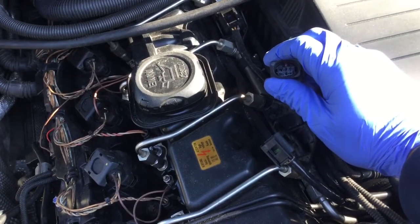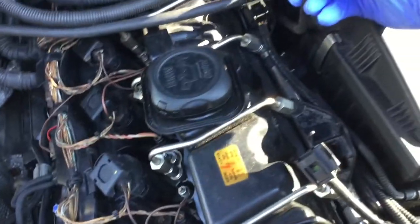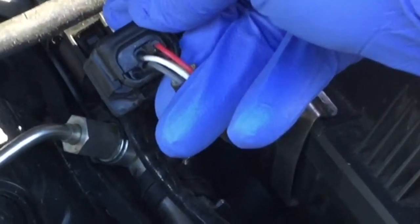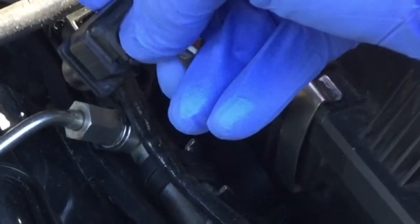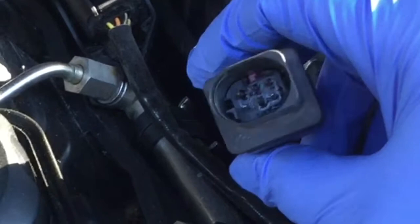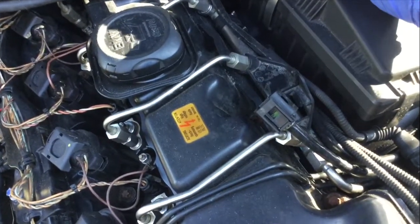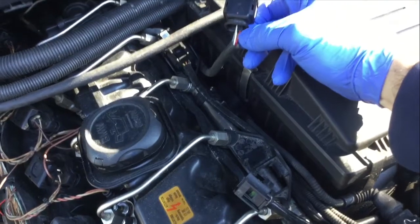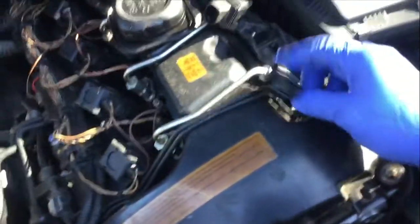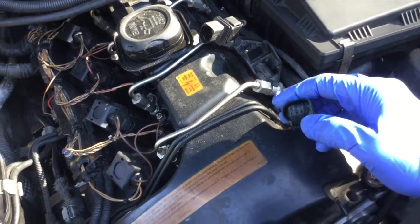This is the connector here. I've got six pins, but when you look at it, there's really just five that are used. One of them is probably interconnected from within the connector itself. So I have to measure resistance from here. But in order to make sure that I've got the right thing, I'm going to check if the red connector pins here — when it connects with this one — if it is receiving 12 volts.